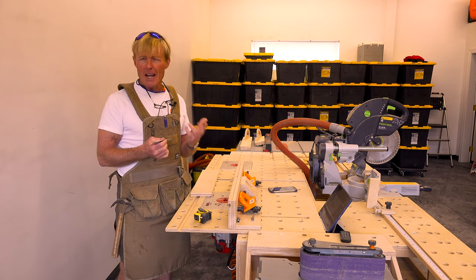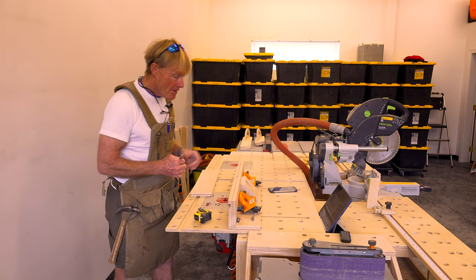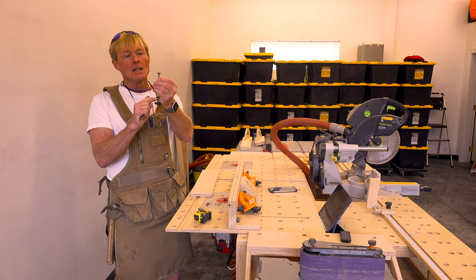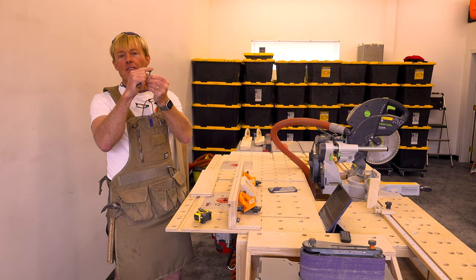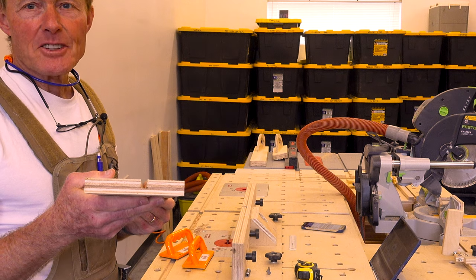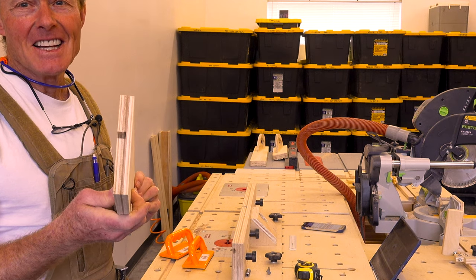It's close to slightly more than 3/8ths. That is because the more important cut will be the T-slot cutter and I find that the top edge of that is pretty close to 10mm. That's the first cut — clean, simple, and easy.